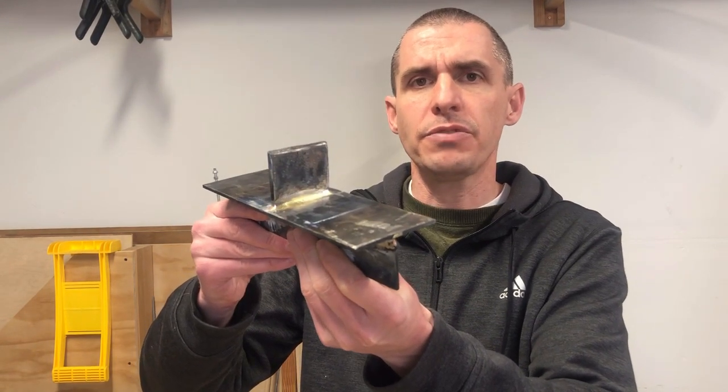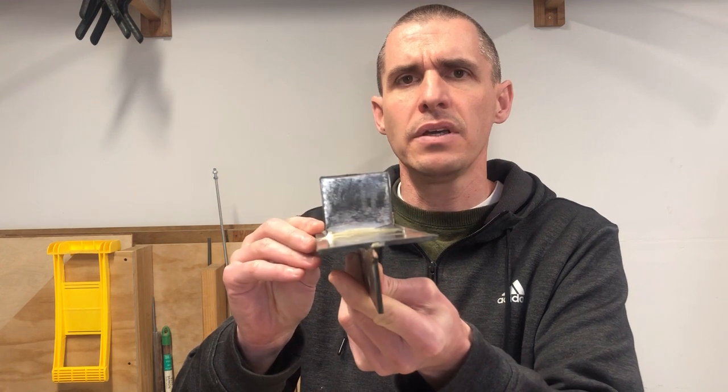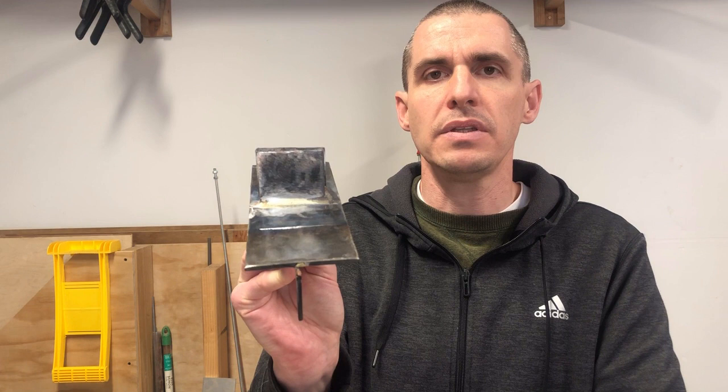Here's the joint — turned out pretty good, especially for such a small torch and the hunk of metal this is. This torch really wasn't designed for doing this kind of thing. I actually caught a pinhole right in the center of the joint — you might be able to see that. But there's more than enough power out of this thing to get a chunk of metal like this up to brazing temperatures. The upper piece is quarter-inch steel; the T is one-eighth inch left over from previous test brazes, which just adds more metal acting as a heat sink. It demonstrates the output this torch can put out.